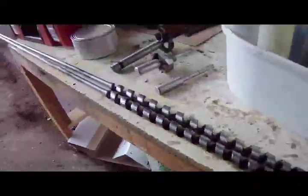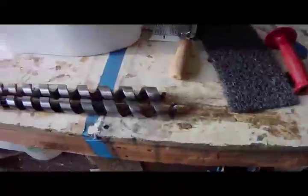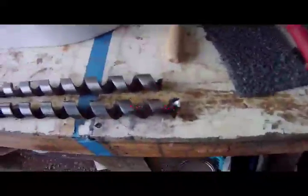We were asked some questions about how we were able to drill the holes in the lead. First, Non-Ferrous Metals alloyed the lead for us with two percent antimony, which made it very easy to machine. These bits here are a standard barefoot auger bit — both were brand new when we started. First we drilled through the wood, then after the lead was put on, we used that wood hole as a guide and bored the lead out with these augers.